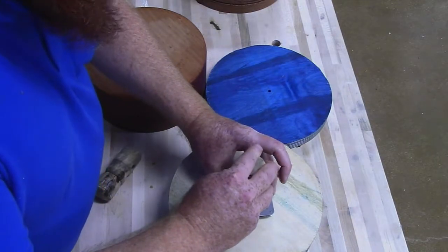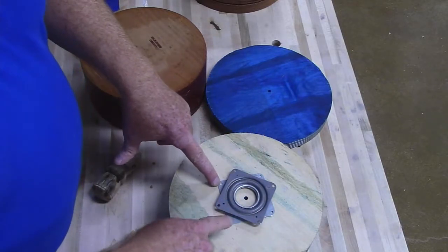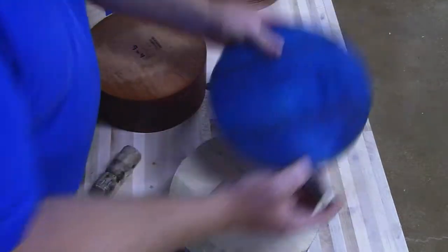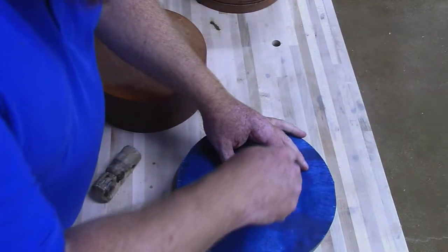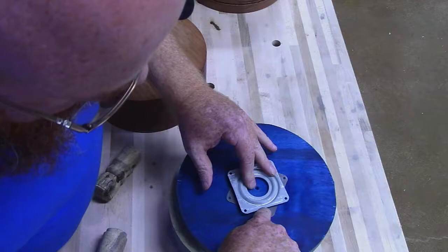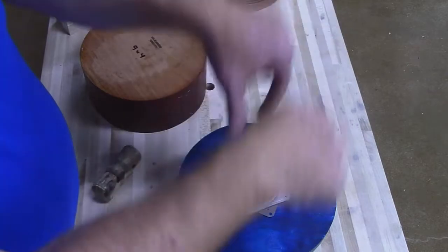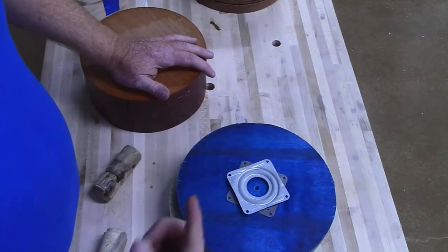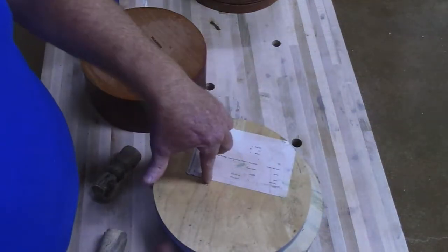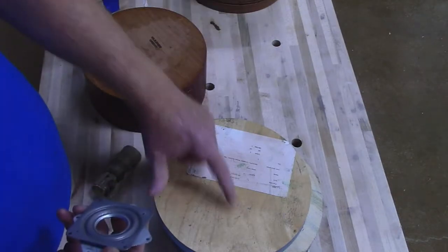I have two of them that I've made pop there. Okay, now this one has four holes, drill those in. And then this one, when you set it on the bottom side, you drill in these smaller holes that are here, and you drill those in from the bottom up. That's why you have to have your holes drilled all the way through the base. And then I use a countersink bit on the bottom and drill in, so that way I have enough clearance. I use like a 3/4 inch screw, but I countersink them down as low as I go.